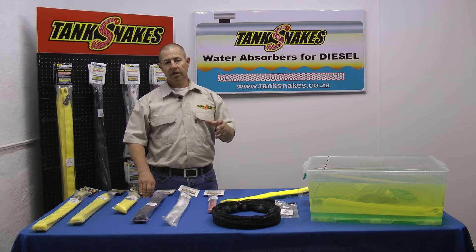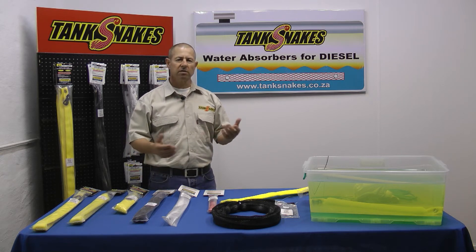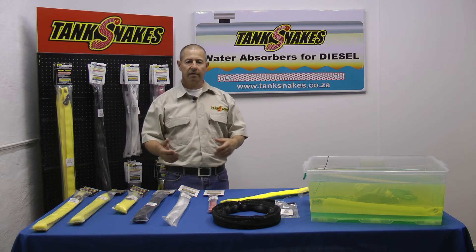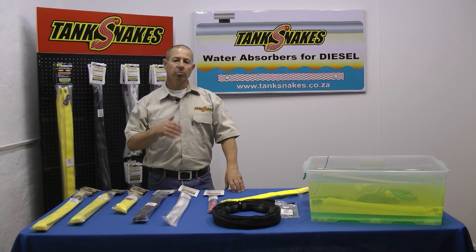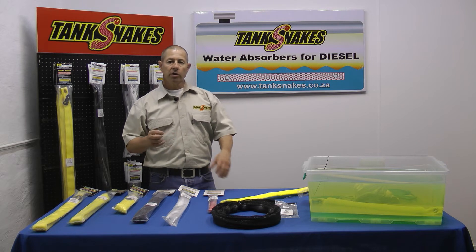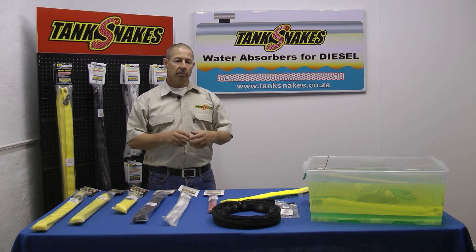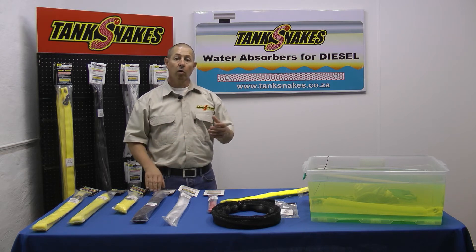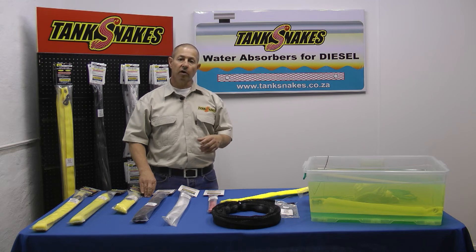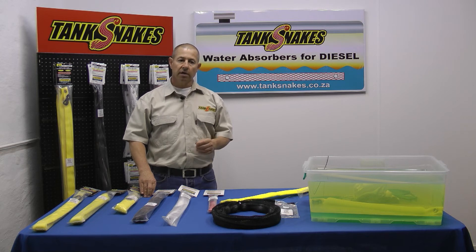When that's there you obviously have issues of corrosion in steel tanks, and then you have the issue of diesel algae, diesel sludge, or diesel bacteria — everybody's got a different name for it — which starts to grow and multiply when there's water in the diesel, normally laying at the bottom of the tank. When you need to run your equipment, this sludge and algae gets sucked through and blocks the filters and stops your engine from running. Or if you're going to decant out of your bulk farm tank or diesel storage tank, this sludge also comes out, causing a huge inconvenience and lots of problems.